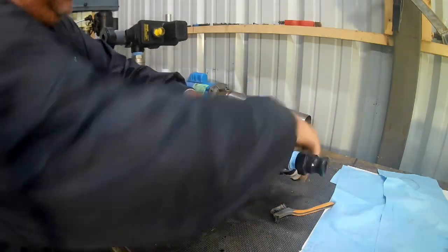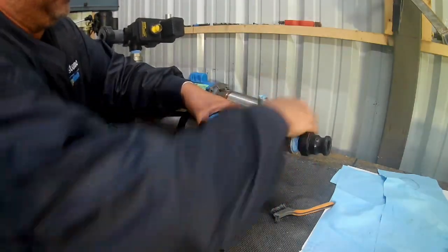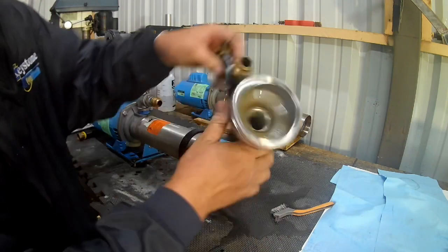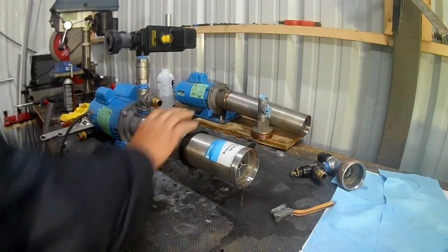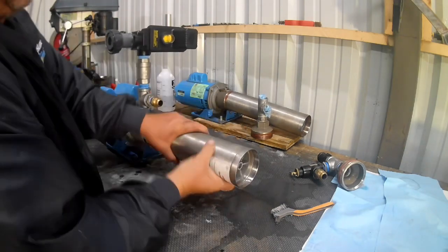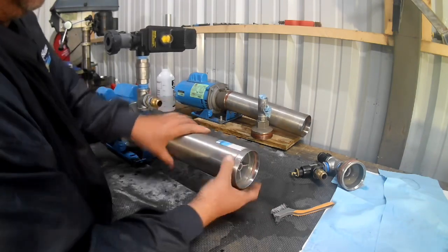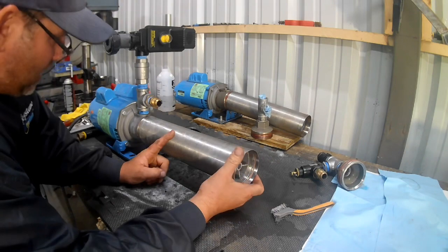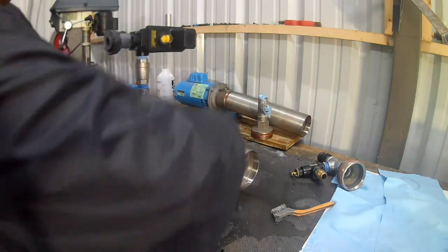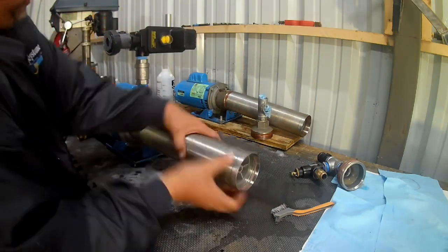Now I've got to tell you a little bit about this situation. This is a 10-gallon-a-minute, two-horsepower booster. This stopped working on me after 20-some hours, and the reason why is because someone did not install the shims correctly. I needed a pump and didn't want to be down. I actually took the guts out of a spare and put them in this pump because I didn't want to disturb all this stuff here — and that was the easiest way.